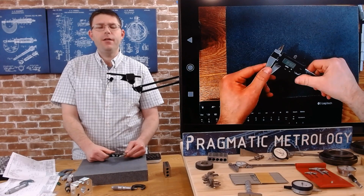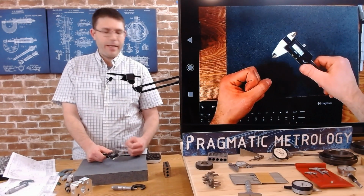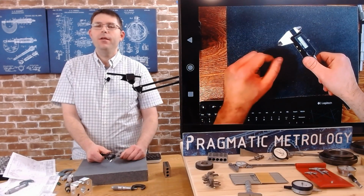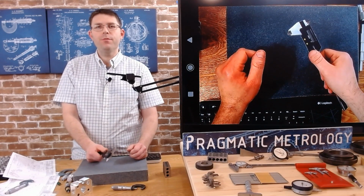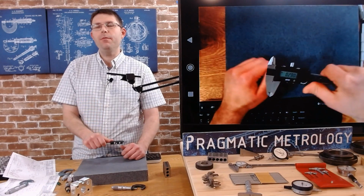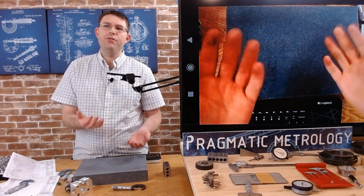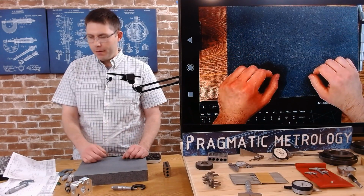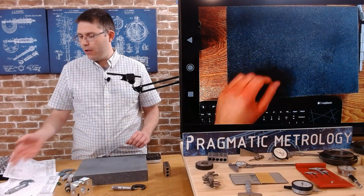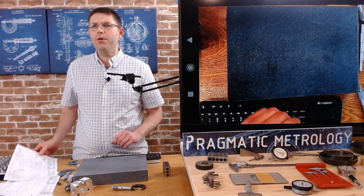And I feel like the micrometer got really solid registration and very easy math. And I feel more confident in that measurement than I do with the depth bar off the less accurate caliper. So even though the caliper is a direct measurement, there's always that trade-off. So I think that's all I'm gonna show you, but feel free to continue with more of these features.